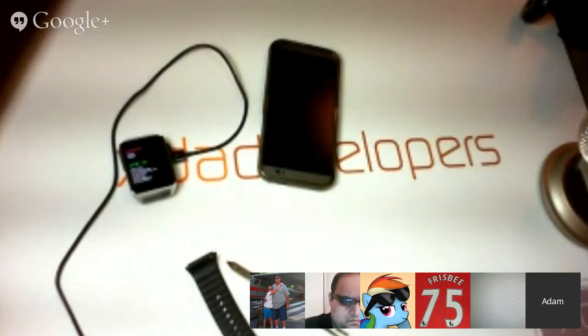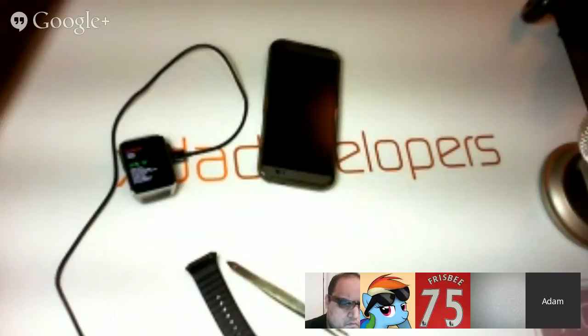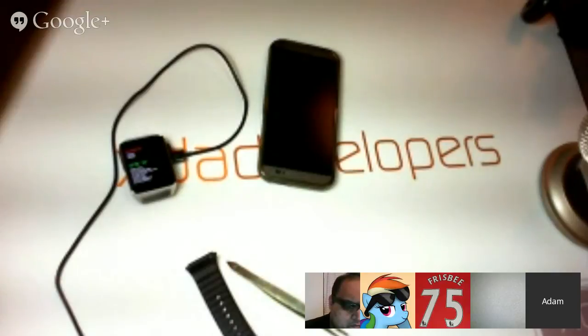And there were a few others too. There's a few for getting the IMEI number and the SIM and the ESNs and that kind of thing too. So there was enable UART or UART on. UART. This is for a different device, though. I'm just trying these out really quick. Device info, that's it. OEM device info. There we go.